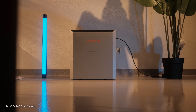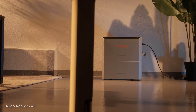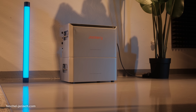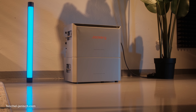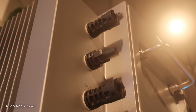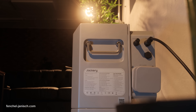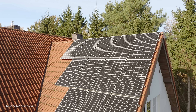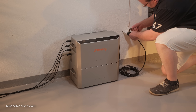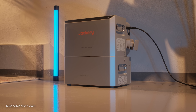Visually, the HomePower 2000 Ultra is elegant and compact. The main unit measures just 44.5×27×27 centimeters and weighs 26.4 kilograms, with a modular design that looks clean and minimalistic even when optionally stacked with additional battery packs. The flat MC4 solar cables and cable tidy collector keep the setup looking neat, even in small places. What really makes the installation stand out is how easy and non-invasive it is. You don't need to drill holes, hire an electrician, or get a building permit in most regions — including Germany, where balcony systems up to 800 watt are pre-approved. Just plug it into a standard Schuko outlet, connect the included 200 watt flexible solar panel, and you're good to go.